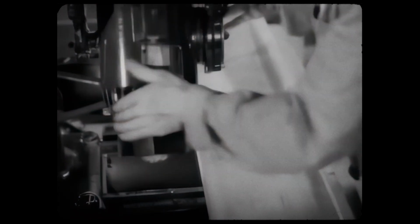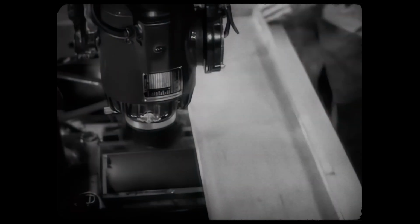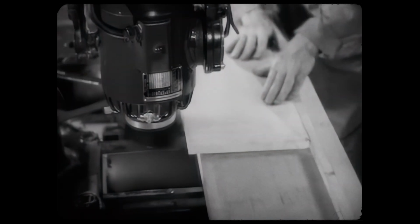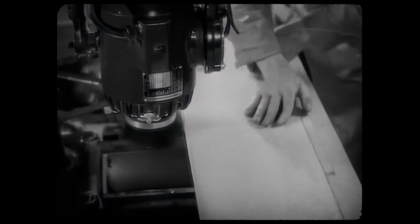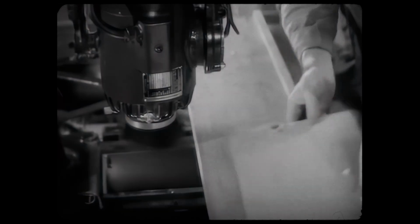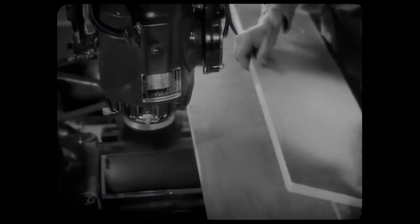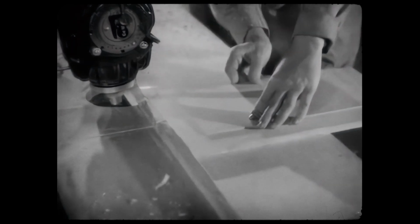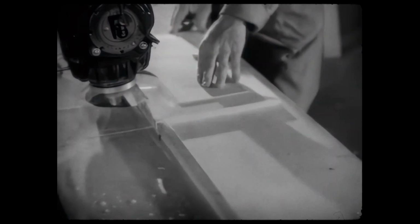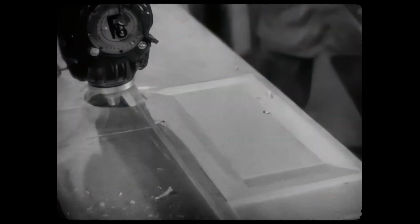By use of a straight matching cutter, material can not only be jointed, but can be sized with stock fed against a straight edge located at the front of the table. By tilting the arbor, panels of any pitch can be raised without changing the panel raising cutter. This also makes for an excellent saving in cutters, as well as a saving in time.